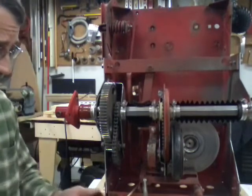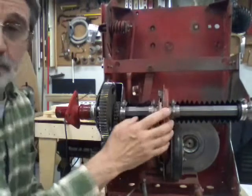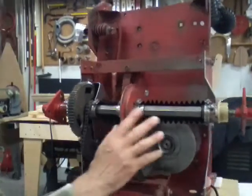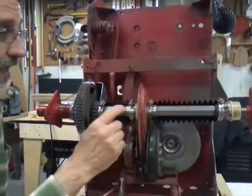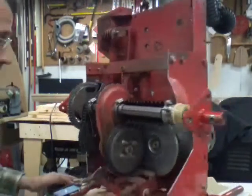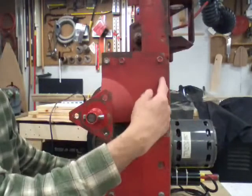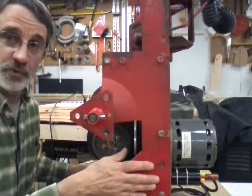I had one guy email me asking how to get his chain case apart. This is about the easiest thing to fix on the Snapper. First thing you're going to want to do is take your boots off on each side of the chain case — just take the clamps off. Then go around to the other side of the machine, opposite of your differential, and take these bolts out that hold the fender.